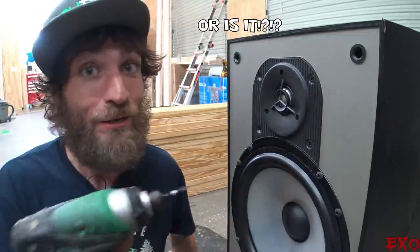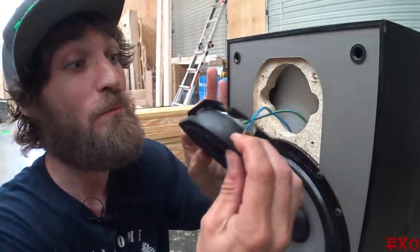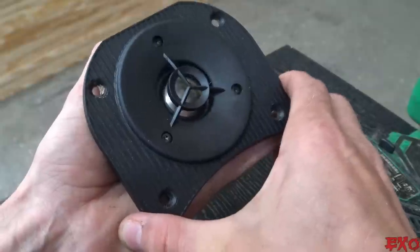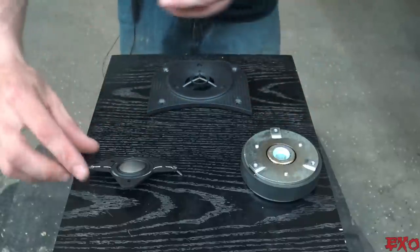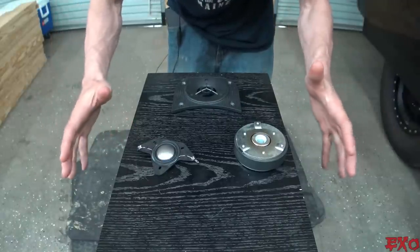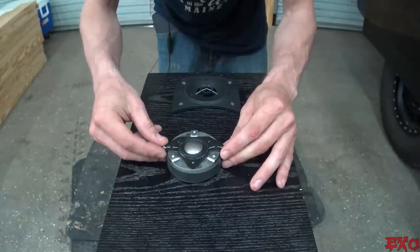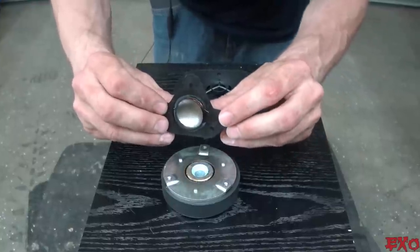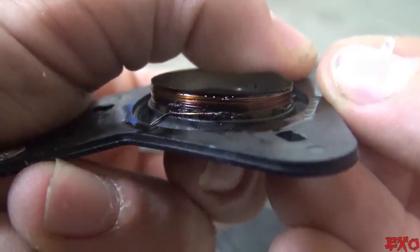Plus, it doesn't help how they made the housing so custom. Look at this thing — can't easily replace the tweeter even if you wanted to. The thing's not even a circle, so no wonder half the people in the same boat since 1997 either got rid of it or tried to sell it for cheap because they thought there was no hope. Now that I'm looking at this thing closer, there's a pretty interesting design going on here. The faceplate actually holds the diaphragm onto the motor. You can see some minor damage on the titanium dome itself — it centers on these little nipples inside the gap. You can tell it had a little bit of leak from the ferrofluid. That's what that orange and red liquid is — it's supposed to help cool the coil even more. We got some delamination and separation there at the former. You can actually see the tiny little tinsel lead just bouncing off, totally separated. That is the cause of the problem.